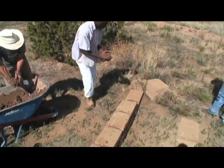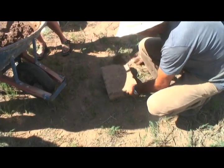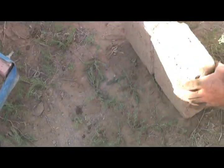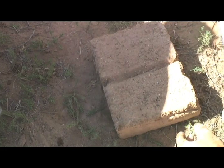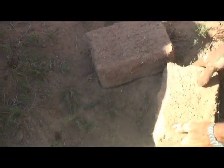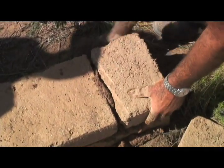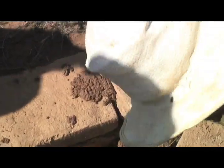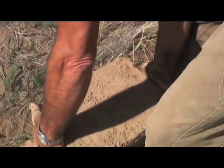The next thing is cutting your brick. With your trowel or a hammer, just go around and score it, and just keep hitting it. All I use is a hatchet. Just throw a little bit here. What happens is with staggering like that, it's pretty clear that it just makes everything lock together.